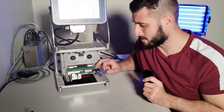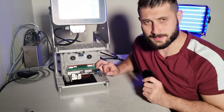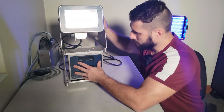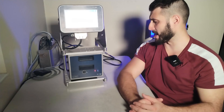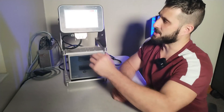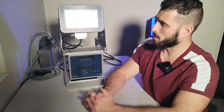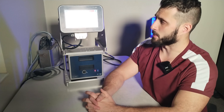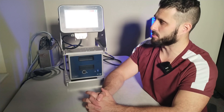Not sure if you can see what's going on next to me, but take a look at this LED flashing. We suspect our incorrect reel size error has something to do with this. It's going through the process of calibrating, just stopped, and E3237 — incorrect reel size. Definition: the size of one or more reels of ribbon loaded onto the cassette is incorrect. Remove the cassette and check that the ribbon waste core has been fitted and that the ribbon rolls are within the supported limits. Refit cassette and press the clear button; the printer will automatically calibrate.